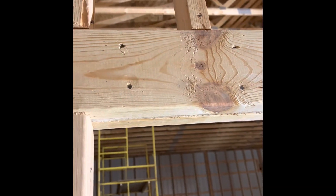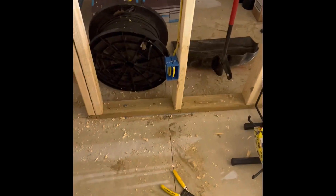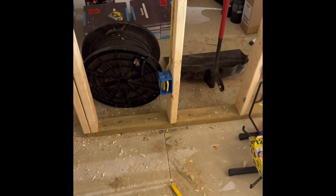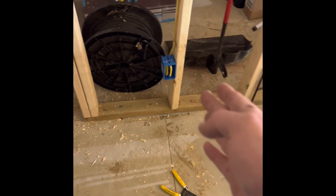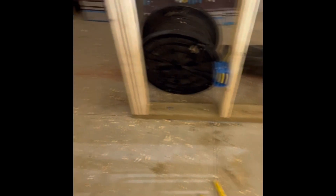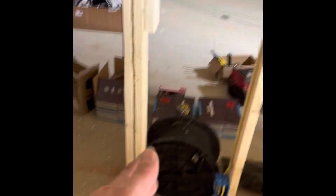So I went across the bottom here, came up, and went through my header framing — I've got to read up on that code; I don't think it's a big deal because the main support is here. Then across and down to the outlet, because this wall would have been over 24 inches. The shower would be like 60 inches, then a short wall right there, so I'd have had a 24-inch wall with no outlet. That door opens that way so I wouldn't be able to put one back there and use it effectively, so I may not have needed one there, but I think it'll be good.